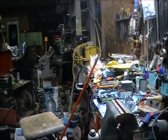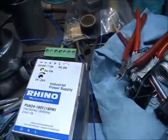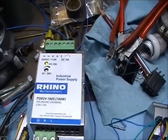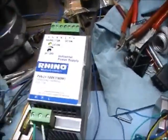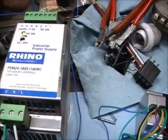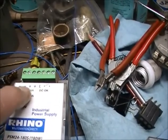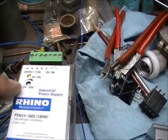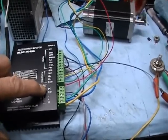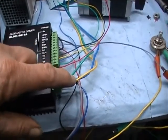I'm going to hand-hold the camera to do this. There's the power supply right there. You hook it up to 120 volts on this side — it'll tap into the welder — and then on this side you get your positive and negative output. I didn't have to hook these two extra wires; it's just one positive and one negative, and I get 24 volts DC out of it, which is also adjustable. Those wires come around to the DC minus and DC plus. Then you've got your three main motor wires: U, V, and W — yellow, blue, and green.